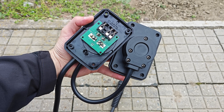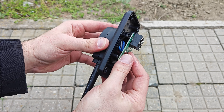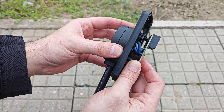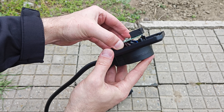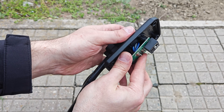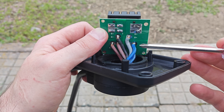It's time to look inside, starting with the adapters — and I have to say I'm quite disappointed with Parkside. Take a look at how terribly this thing is designed. Due to the rotation in the adapter, those cables will eventually snap at the soldering points — and not only will you lose connectivity, you might short circuit the cables. Absolutely awful design. All of this should have been done with some sort of sliding contacts, definitely not by twisting cables.